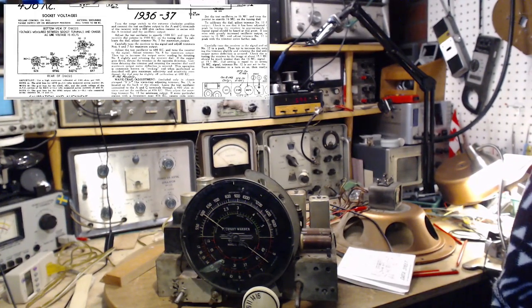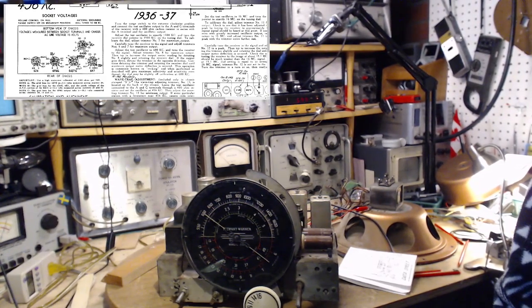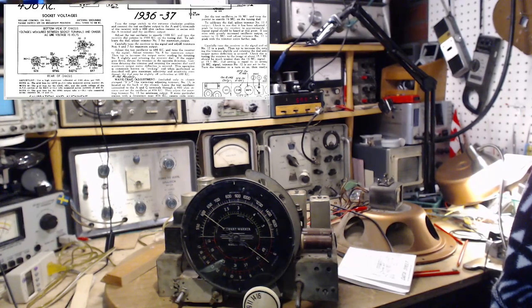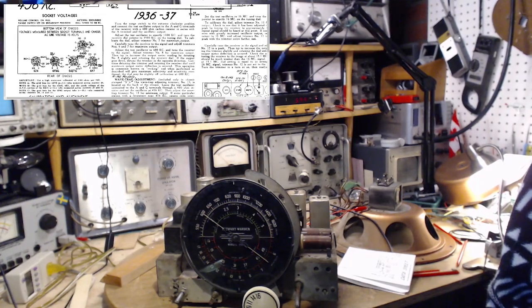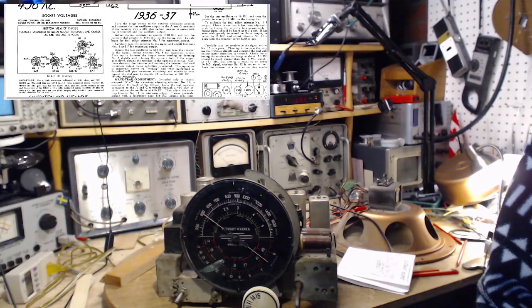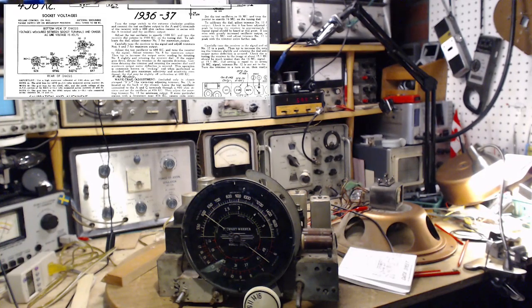Then try to increase the output meter reading by detuning number 8 slightly and retuning the receiver dial. If the output goes down, detune the trimmer in the opposite direction. Continue detuning the trimmer and retuning the receiver dial until the maximum output meter deflection is secured. This operation is commonly known as rocking, and when performed as described will give maximum selectivity and sensitivity, even though the dial may be slightly off calibration, the 600.